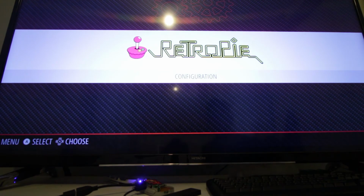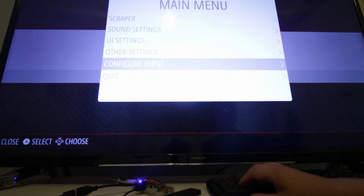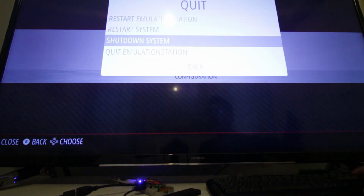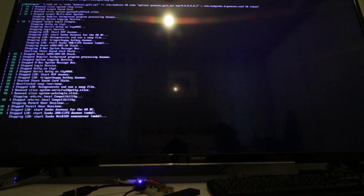Okay, so now it's time to set up your GPIO to the controller. So again, you have to quit the emulation station. And then, again, you can find this in the description below. So once that's done, hit enter, and that should just map your GPIO pins to the controller and reboot the system.